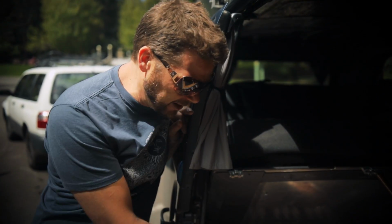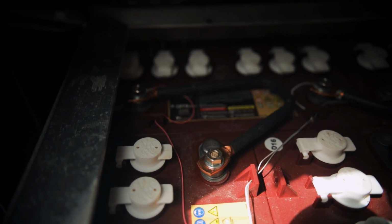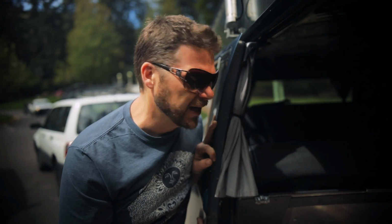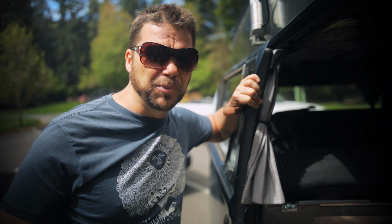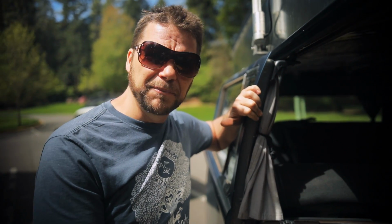So I made my own wires by smashing some copper rod and making sure that each battery has a perfect torque connection, and you really notice the difference. Each battery then can contribute evenly and much more efficiently. I'll get about 80 amp hours per battery, pulling anywhere from 100 to 250, 300 amps out of each battery, and that gives me my 50-mile range.